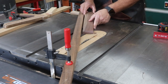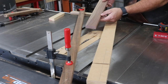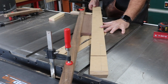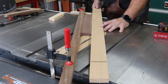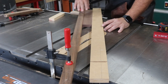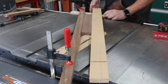Next up, I need to put the piece that I'm going to cut in place up against this fence and then set my outside fence. To set up the outside fence, just set the piece you're going to cut into place and then put that outside fence right on the outside — that's going to give you the correct angle. The important thing to note is make sure it's not so tight up against your piece that you can't slide it freely all the way through. I'm going to use a spacer on this side and clamp this fence into place.